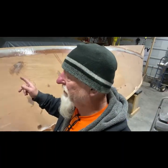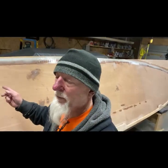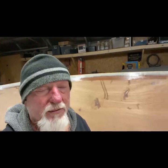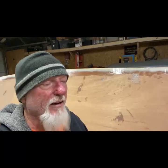This was several coats. The first one was high density filler mixed with epoxy for a strong fillet. Then I started mixing in a little bit of low density, which is better for sanding. Done my second coat over that and it makes it a little smoother. The next one will be even more low density and a little less high density — I'll mix them together a little bit as I go on each coat.